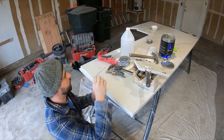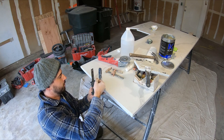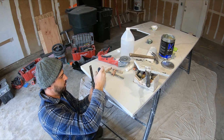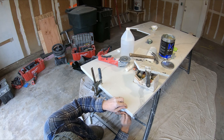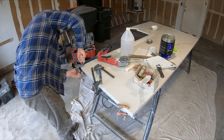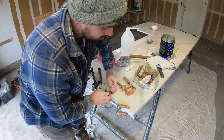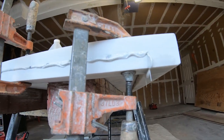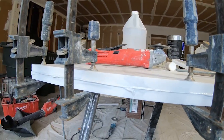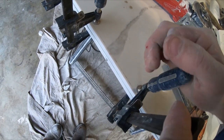When you start clamping this piece, don't over-tighten it — just snug it, then one by one. If you tighten the first one too hard, you risk cracking the strip you cut for your bullnose. That happens a lot more with natural stone, not as much with quartz, but I wouldn't risk it anyway. Make sure you do it correctly. Give it a once-over look, make sure everything is perfect, nothing has slid, tighten one more time, and just let it dry.